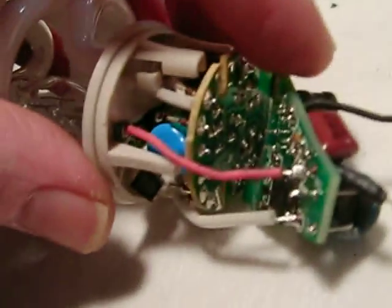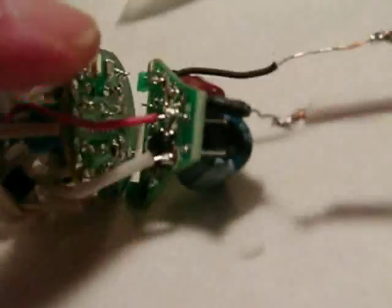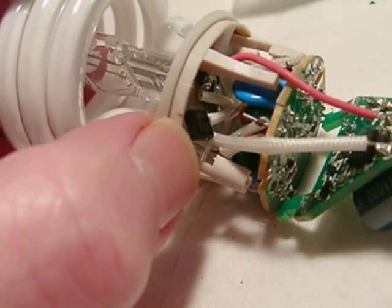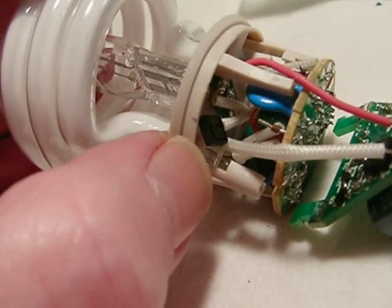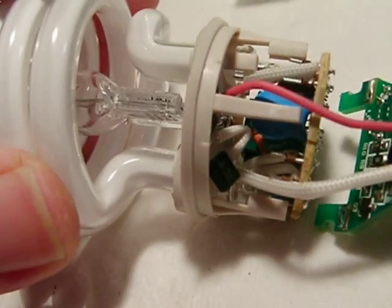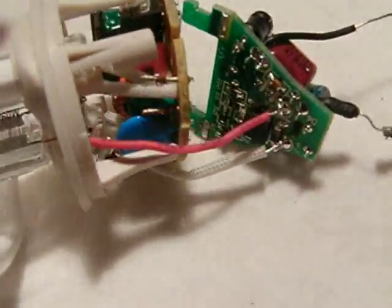This thing works via a little T-shaped circuit board that solders to another circuit board on small tabs. They even mark the halogen connections as H1 and H2. The connection goes through a thermal cutout - this is a safety device only. If the internal temperature of the bulb reaches 150 degrees centigrade, it will cut out and render it useless. That's a safety factor required to get it through certification.